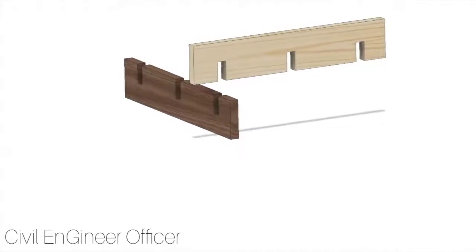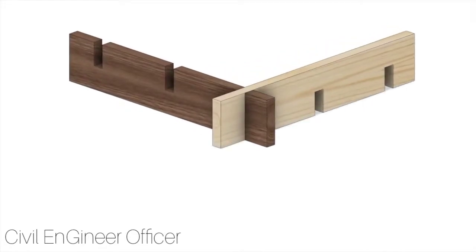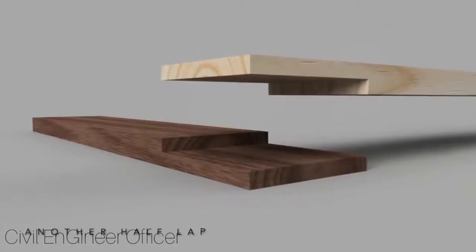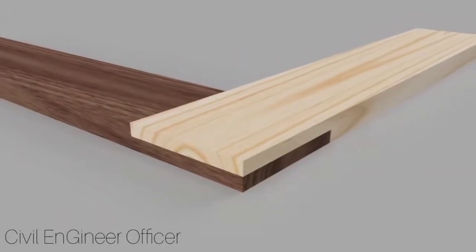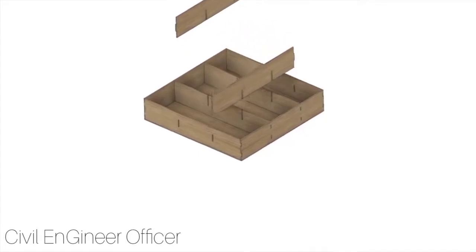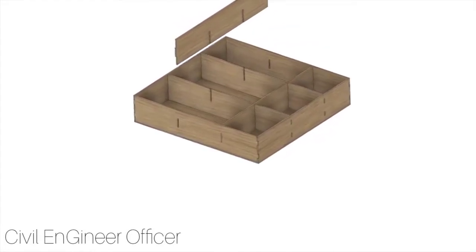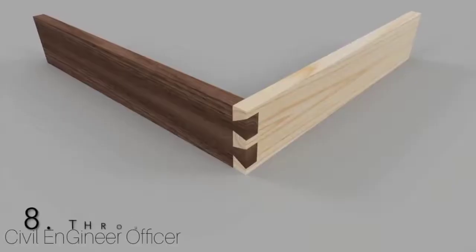The half-lap joint is where half of each of the two boards being joined is removed, so that the two boards being joined together flush with one another. This type of wood joint can obviously weaken the strength of the two adjoining boards, but also is a stronger joint than butt joints. There are a number of projects where this type of wood joint is quite desirable in spite of its drawbacks.